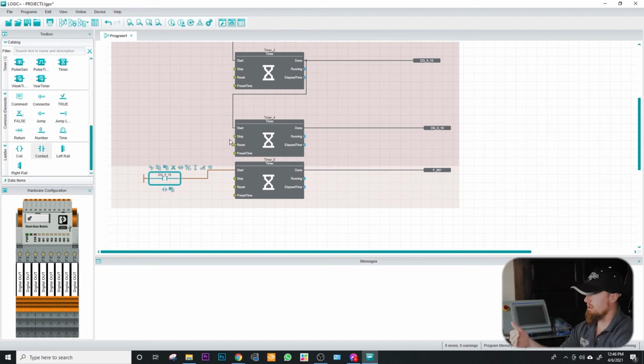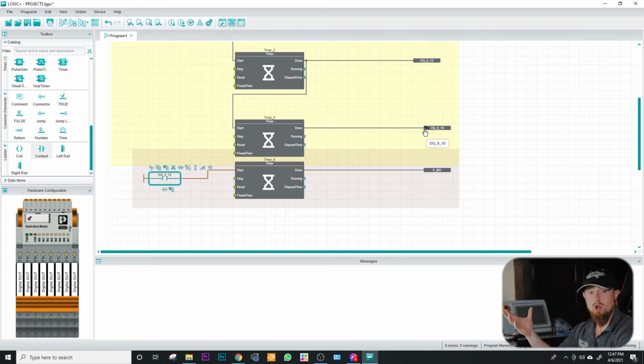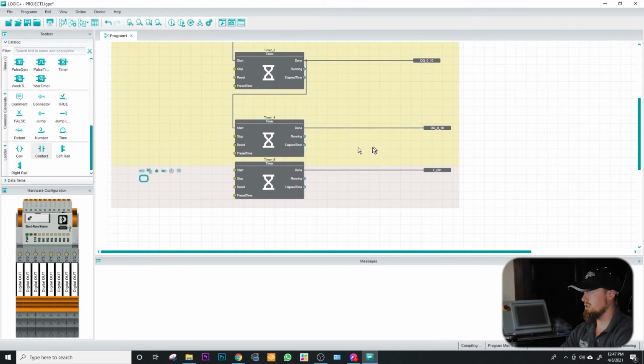You can see a lot of different structures within the two different languages. And to be honest, when it comes to function block programming, I've not done a whole heck of a lot of it other than on safety devices. So when it comes to standard logic, I'm not exactly positive on how the scan sequence works with firing this and then firing an input from that output, versus doing like we did on these other timer instructions. So just keep that in mind. This type of programming method versus this one here can potentially have effects in your programming depending on the programming language you're using, because something that may work on one platform may not work on another platform. So I'm going to go ahead and just make this universal like I did with everything else. And I'm going to drag this one down. And maybe we'll test that one out and just see how it acts in a second.